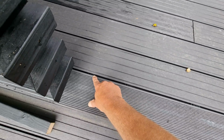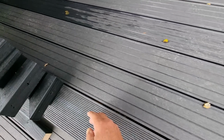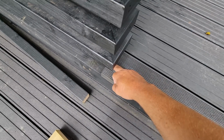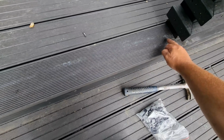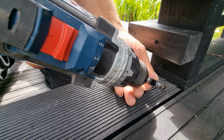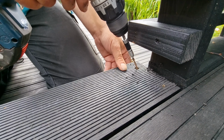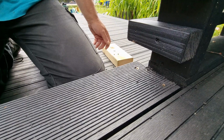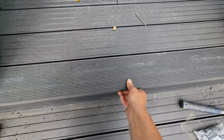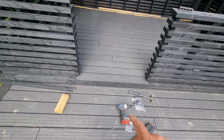Got these little clips to hold it back at the back, but nothing at the front. There's like little angle clips folding, you know, like end boards on. I put them down there. But here, this is going to get mitered around there, little skinny piece. But I'll be able to put a screw in that end, and I think it's going to have a couple of screws in the middle. Those back ones might pull through in time, but deal with that later. Quite firm, I'm going to avoid putting a couple of screws in the front. See what it's like.